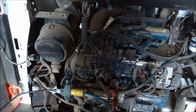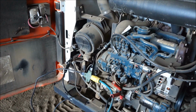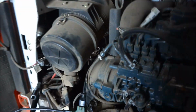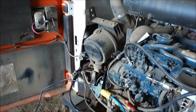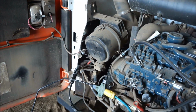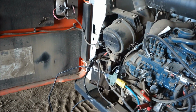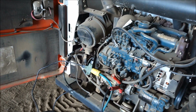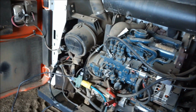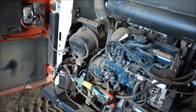And then I also brought the battery charger here. I just had a couple issues the last couple times I used it. I mean, the battery is decent yet. It shows on it that we bought this skid loader new, and its battery's from 2012, so it is 6.5 years old, which is pretty good lifespan already, but we've had them go 10, 12 years. It works just fine in the summer, but in this cold weather, it didn't want to quite work as it should, didn't crank it over, but when it was 30 degrees, it did just fine.